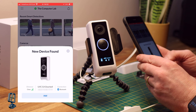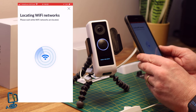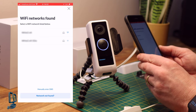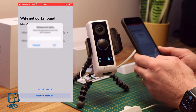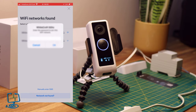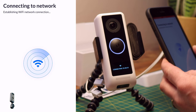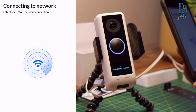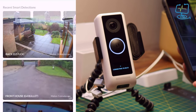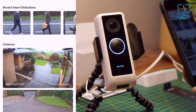I click the Add button. I've already got a couple of cameras on this setup which we'll see later. The doorbell is asking how I'd like to connect — it's not connected via network cable so it will connect through Wi-Fi. I'm connecting mine to a 5GHz channel in the office. I put the password in and it is now trying to connect the doorbell to Wi-Fi. The front screen of the doorbell also says 'Connecting to Wi-Fi' as the app spins. Setup is complete, and I'd expect it to do an update next.